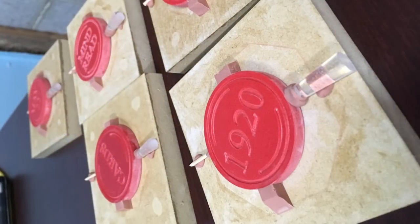So let's just talk about how we do it correctly now that I've figured out my screw up on this one. It's different every time, so you're reinventing the wheel every time, and it's one of the reasons why this is so difficult. So instead of doing it this way, here's a still of the actual apparatus that I set up. And everything that you see above this image, above the little clay tabs grabbing the side of the coin, above and around the evacuation hole and the injection hole, all that air that you see above that is silicone. So this is how it comes out after you don't screw it up.